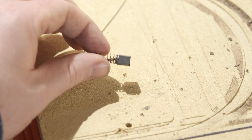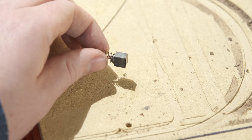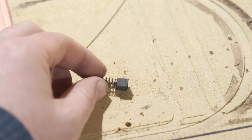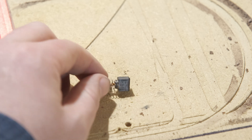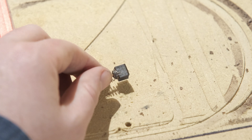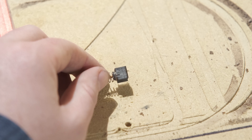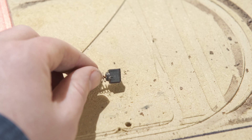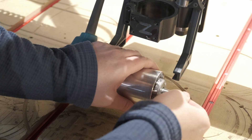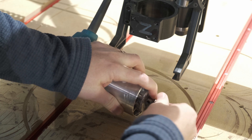I'll try to find a link and put it below. This amount right here is still perfectly fine, and I'll probably replace them next month. But I'll slide this back in and make sure the other one has the same amount of wear. The second one is actually a little bit shorter and approaching that wear line, so I'm probably going to replace these sooner than I originally thought — just order some on Amazon and pop them in. Always make sure you're checking your brushes. Now we're just going to pop the collet back in and put the collet nut back onto the shaft.